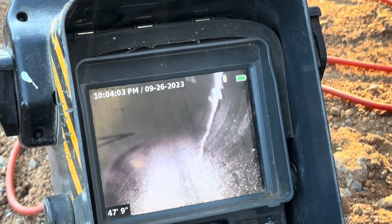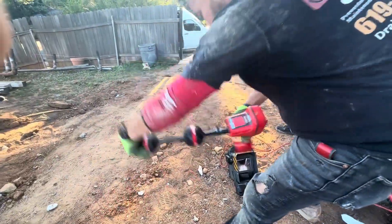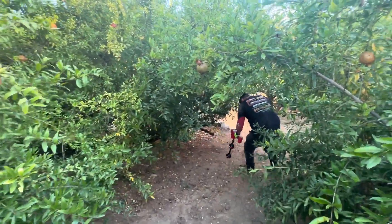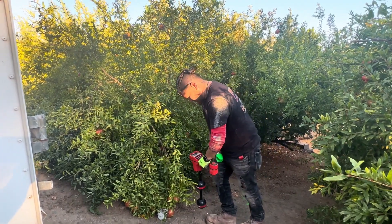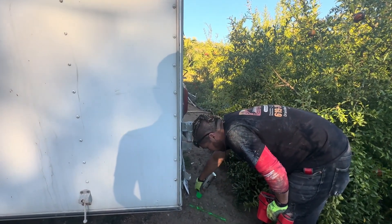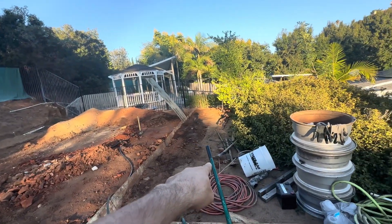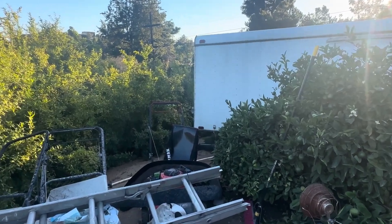If correct, the connection point should be close to the trailer, maybe down a little bit. We calculate that we just need to connect somewhere around these trees. We're marking it at one foot three. So from this point, our bathroom will be roughly in the middle of the structure — we'll come straight out with our sewage line, go at a 45-degree angle, and connect right there at the bottom of the trailer. You can see the green mark.